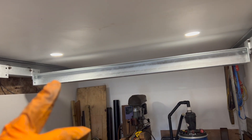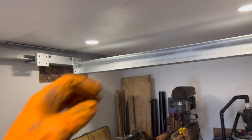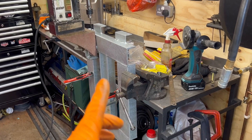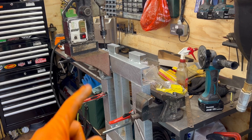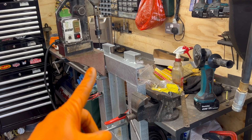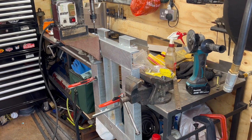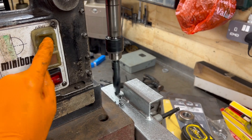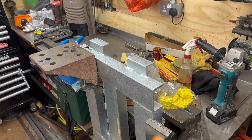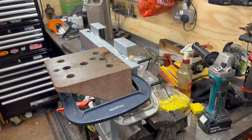We've got one of the beams in now — just put on the lower holes for now so we can assemble the gantry and then lift it one side at a time. We're putting the other beam on and finishing off the trolley that's going to hold the hoist. My friend Matt and I clamped down an angle plate, measured it all up for square, and we're drilling pilot holes with a 6mm bit then opening up to 20mm holes for the bearings so the trolley can roll across the top of the two beams. I've done a pilot drill of about 8mm all the way through, and now I've got the 20mm drill ready to go.